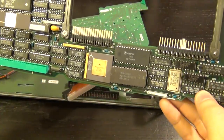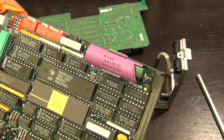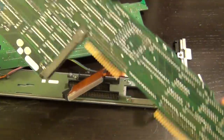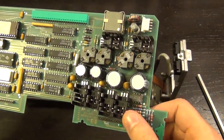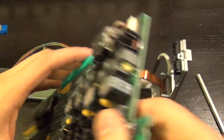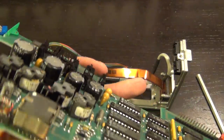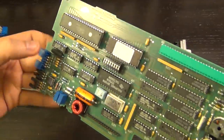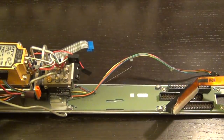There's nothing fancy on this board — a crystal, various logic gates, a couple of custom components, a battery that looks good, selecting switches, tiny LEDs, and some switches. The last board here is obviously the DC-DC converter and regulator board — nicely filtered with larger capacitors, including 2200 µF 10V electrolytics, and another power supply filter. This likely drives the microwave relays at 28 volts as well.